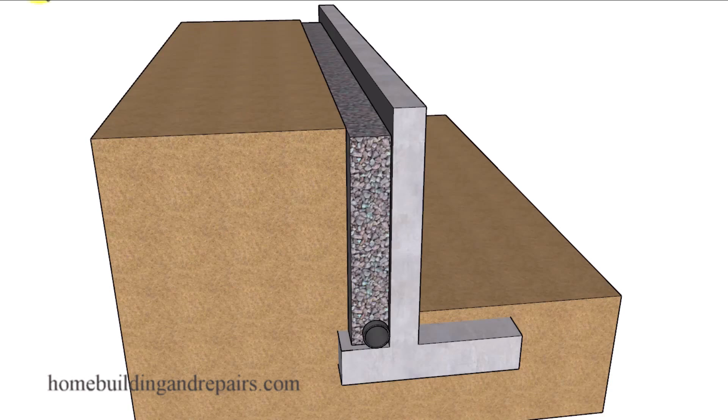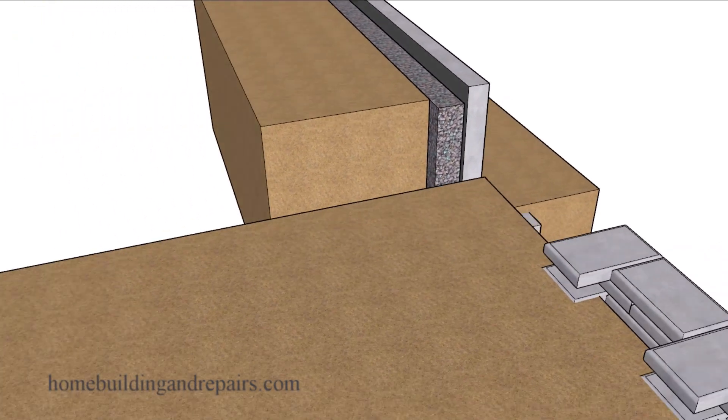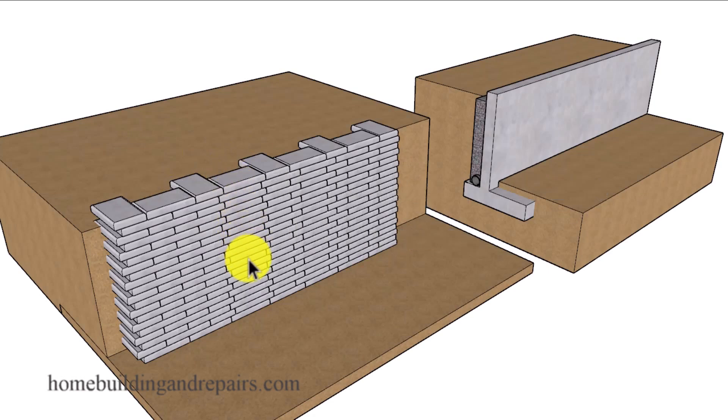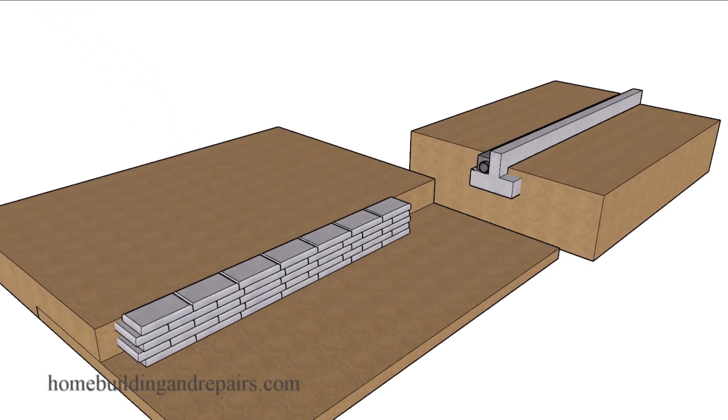For those who want to build this wall out of concrete bags anyway and are thinking about installing gravel and a drainage system behind them — that's probably not going to work either. You can remove the water and prevent tree roots from entering, but the water trying to go around the bags will usually be enough to destroy a taller wall. Something shorter is going to work a lot better than something taller.